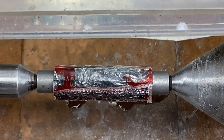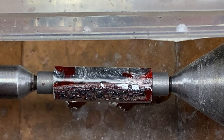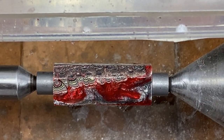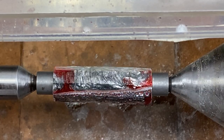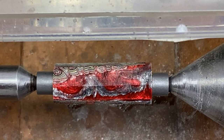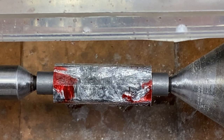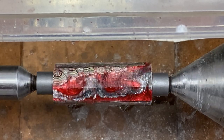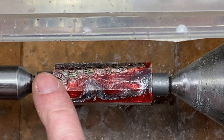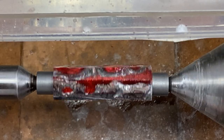What I'm gonna do is just sort of slowly spin it to keep the CA — let it run around the blank and get an opportunity to dry. I spun the blank for quite a while and I gave the thin CA plenty of time to soak in. Initially I said I wasn't going to use activator, but after about seven and a half, eight minutes I figured what soaked in has soaked in. The rest of it was just pooled on the surface because I put it so thick. I gave it a quick shot of activator just to harden the surface so that it wouldn't throw everywhere when I fired the lathe up.